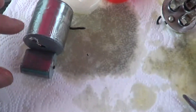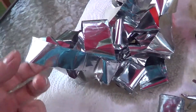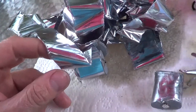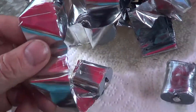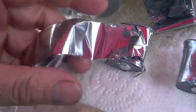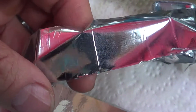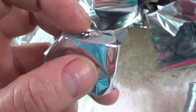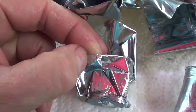So let's start unwinding them and see what we get. On the good capacitor, unwinding it — it's very long. It's a very thin layer of plastic, and it's aluminized. Notice it has a transparent side to it, and then the aluminum goes all the way to the end. Basically they roll it up and then they use a solder blob — molten tin or something — and it basically just attaches itself to the aluminum.